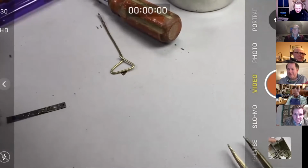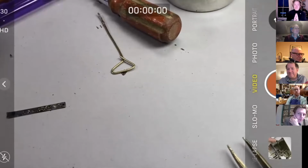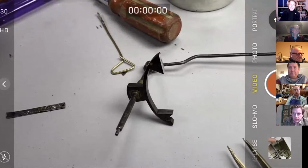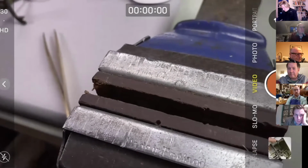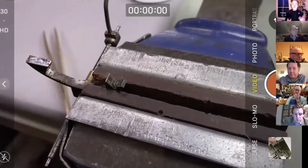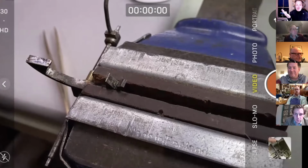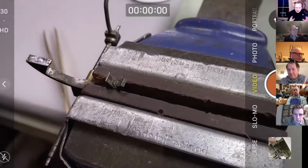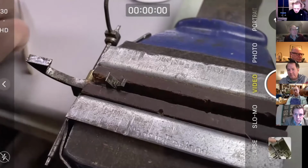Good. So that's, if you get to that stage and both bits of material are neatly tinned without going black, then give yourself a massive pat on the back, because that actually takes a bit of practice. It sounds self-congratulatory, but I was very nervous about that going really wrong. So back to our soldering the thing together. I'm just going to join them together now, because if you've not soldered before, both bits have got a layer of solder on them, when you put them together and reheat them, they just stick together. It's a really critical point of soft soldering.